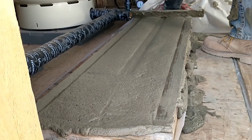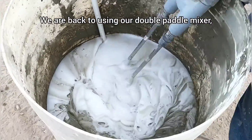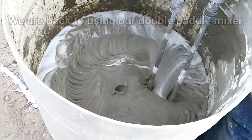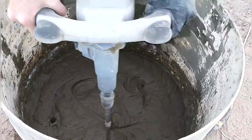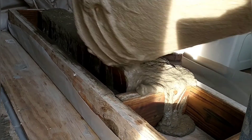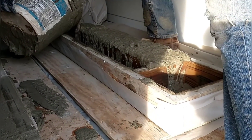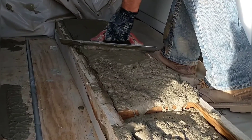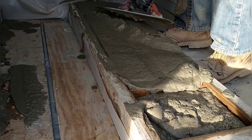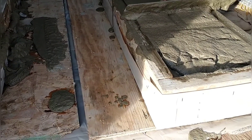We're making some batches here that use fiber additives. Not being able to make the strongest aircrete lately got us thinking about whether there's anything we can add to strengthen it. We got recommendations to try fiber additives, particularly fiberglass fibers and basalt fibers. We decided to try that and see if adding those would add significant strength to our mixtures and keep them from micro-cracking. We bought some basalt fibers and fiberglass fibers, using two ounces per half batch — about a quarter pound per full batch ratio.